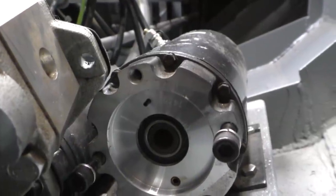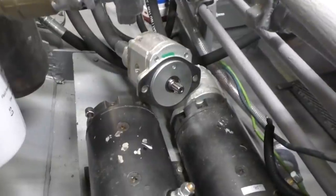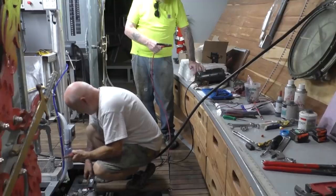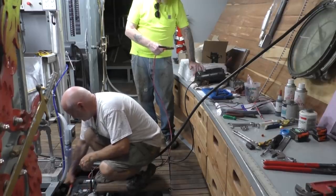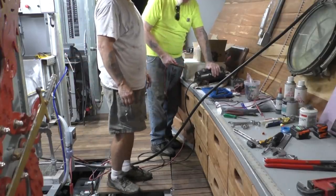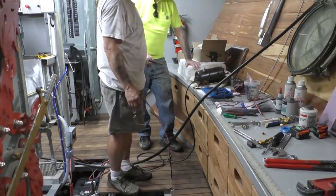Flip the breaker again. Well, so we eliminated the pump — it's got to be the motor. We're going to try giving it a 12-volt jump off our batteries down there. The lead asked to crank over the engine. Red is negative, right? Oh, that's positive. Hit it on there and hold it. It's running! It doesn't like the breaker, or it's not 24-volt.